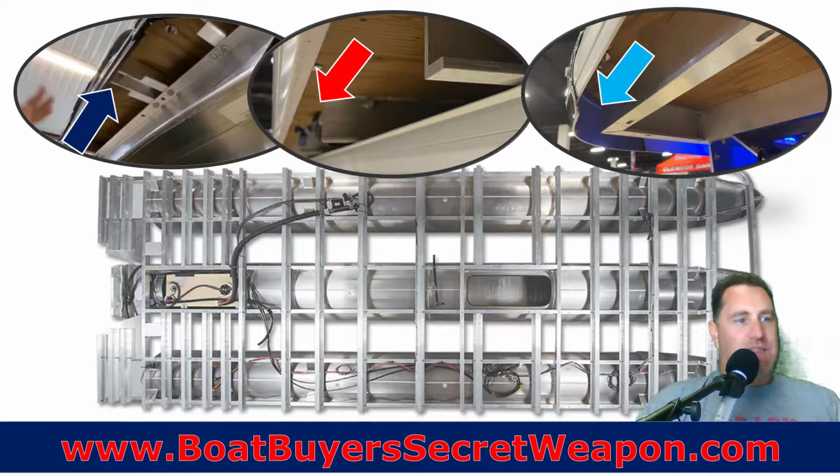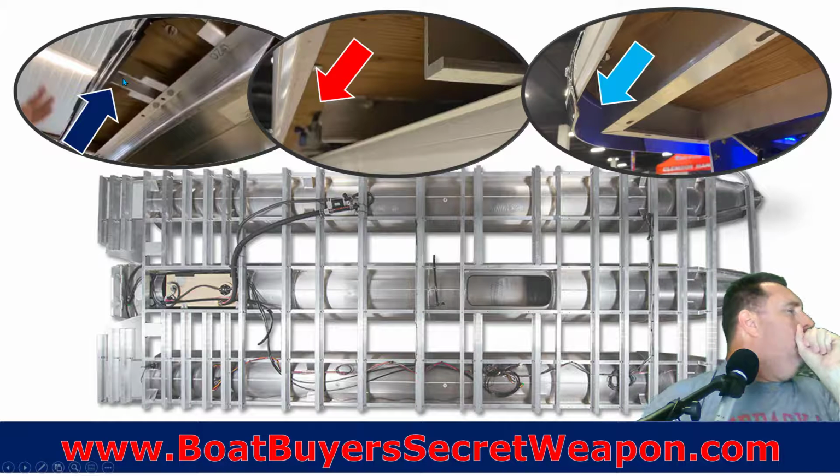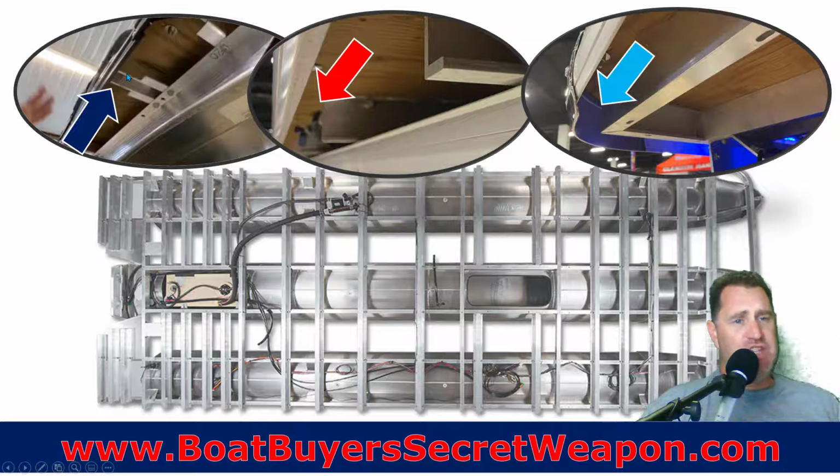So at this point, another manufacturing decision to make is, how long are we going to make our cross members? Are we going to make our cross members 8.5 feet wide like you see here? Because the sheets of plywood are 8.5 feet in most cases, the full width of the boat, I'm sorry. Or are we going to cut our cross members at 8 feet and leave a 3-inch gap on each side before we hit that finish piece? It's going to make the boat more structurally sound, but more expensive. Less structurally sound, that's not the right word, less stout, less sturdy, but less expensive.